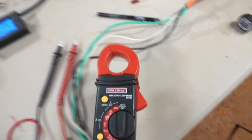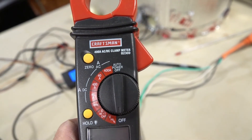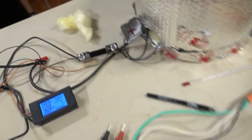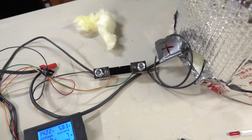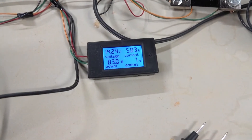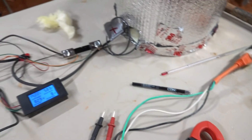I need to mention one thing. This is a Craftsman clamp meter — I've had it several years. It's an 82-369, 400-amp AC/DC clamp meter, so we're really working the low end of this. That's a 100-amp shunt — very low resistance. They measure the voltage across that and calculate the current. It's hard to say which is more accurate — this or this — so we'll just see what we get towards the end of the day.